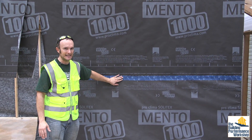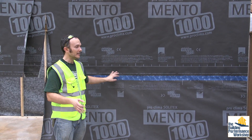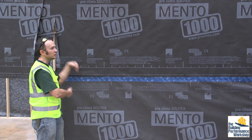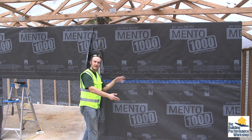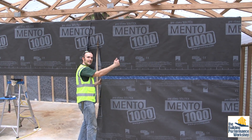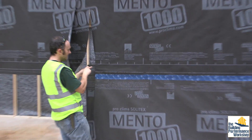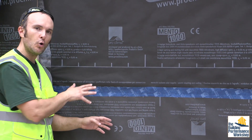It's going to give you air tightness, which is awesome, but it doesn't have to be tight — it can be loose. That's okay because you don't want to be ripping all the staples out. The way you put this on is with two courses, each five feet wide. You put on the bottom course just like shingling a roof or flashing — put on the bottom and staple at the top. Then you put on the next layer with overlap, so my staples for the first layer are up here, and then I tape beautifully over that so the staple holes don't matter.